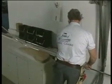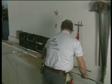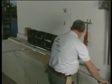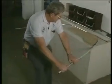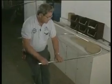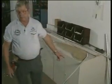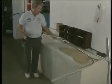Put it back in the bender, put the leg length mark on the leg length mark on the bender. Get it level out here. If it's laying on a table like this, it is level. Keep it in the groove. Use all the leverage you got. Bring it around to about a right angle. Let it spring back. Let the bender hold it so that you don't have to bend over and pick it up, because I'm too old and lazy to do that anymore. So I let the bender hold it while I walk around here.